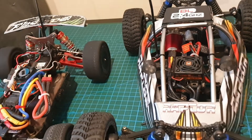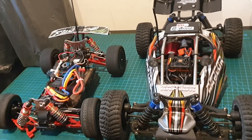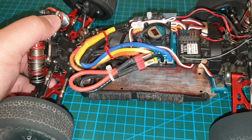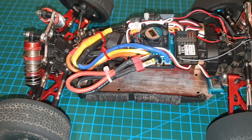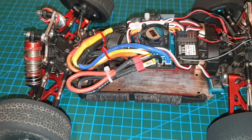The ESC programming may be slightly different for other models, but hopefully these two will get you started or give you an idea on what you need to do to program your ESC without a programming card. Basically, your ESC — or most ESCs — have the ability for you to change some of the parameters. Those parameters are basically features such as your low voltage cutoff threshold or maximum brake force percentage, things like that.